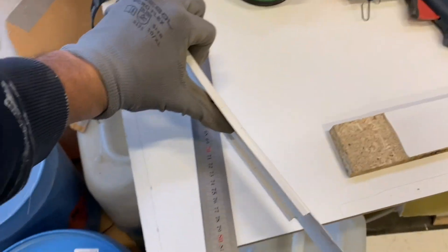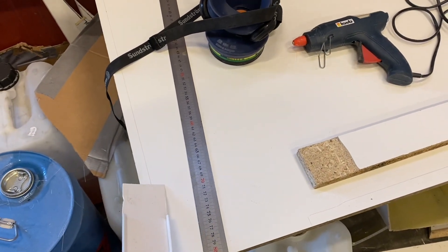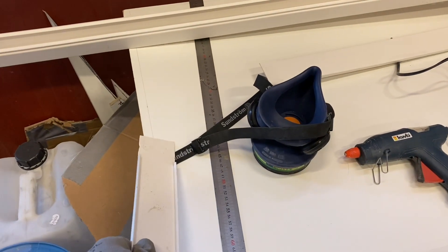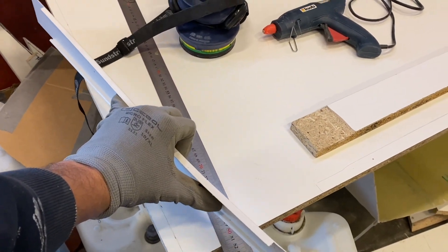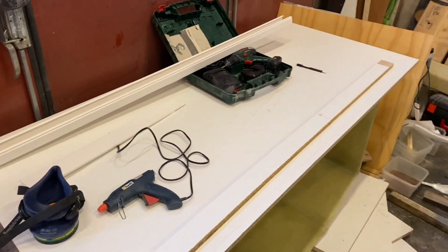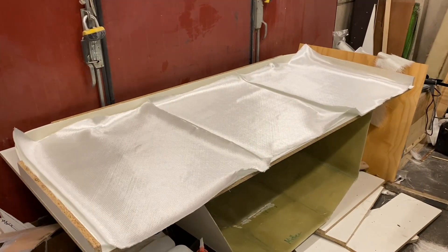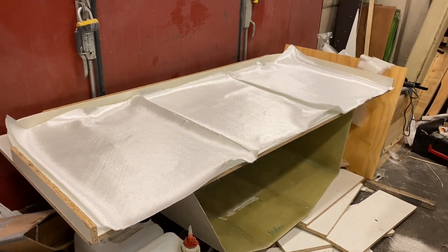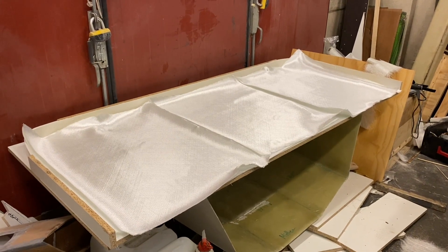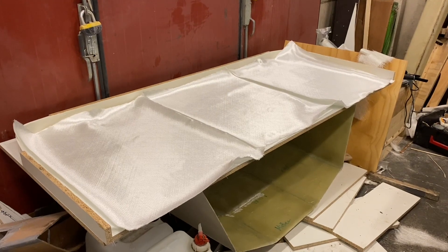These plastic lids are great because the polyester, resin, gel coat and everything doesn't stick to them — which is a good thing. Now the form is done, and I've started to lay out the cloth. This is 600g biaxial and I've cut it into three pieces, slightly bigger than needed. I'll adapt it to the actual bracket once it's done to make it fit, as you'll see later on.